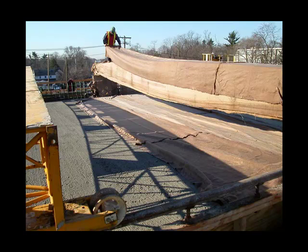Here's a setup that I think is ideal — what you should be moving towards for curing concrete. This shows a bridge surface where the concrete is very freshly placed and immediately covered by curing blankets that appear to have already been pre-soaked, so they are damp as soon as they go on, and periodically wetted down during the curing period. Of course, a lot of attention must be paid to flat surfaces exposed to sun and wind, as they will dry out very quickly and need immediate attention.